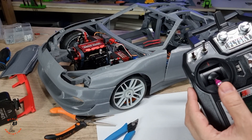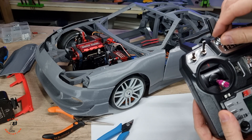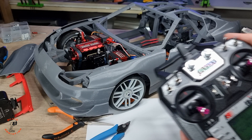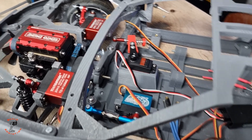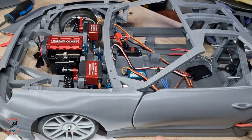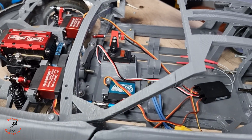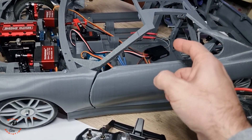The clutch is working very well. I had to put a spring over there — it's gonna push the clutch and give protection to the arm so it doesn't break. What's great about this transmitter is that you can set the endpoint and starting point, which is why I'm using this one. For now it's working very well, but I still have to put the transmission together and make a mount to connect it with the clutch.